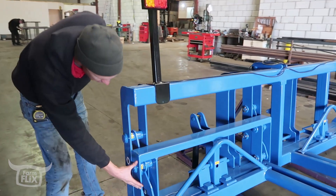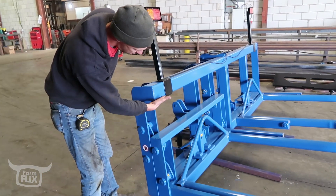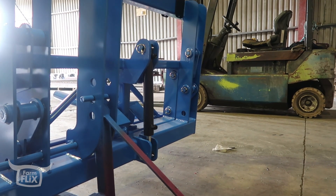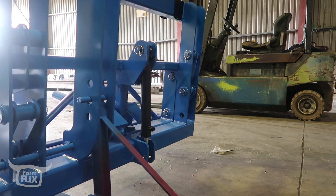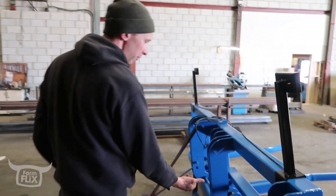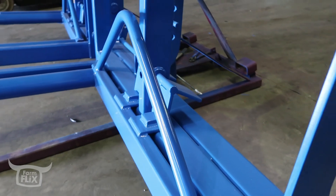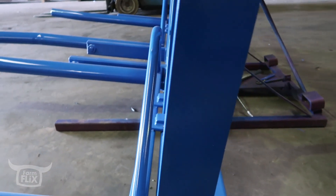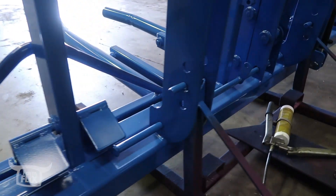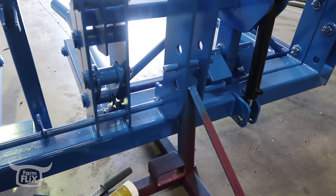So this bit here - you go put your first bale on here, lift that up to there, and that gives you clearance to lift the second bale. She'll tip them both, or if you only wanted to tip one - if you keep that one up, then the trip mechanism misses it. So you could tip that one without that one, if you had an odd number in a row, or even sometimes in winter, tip one field and then go on up the field or into a different field to tip them for winter feeding.